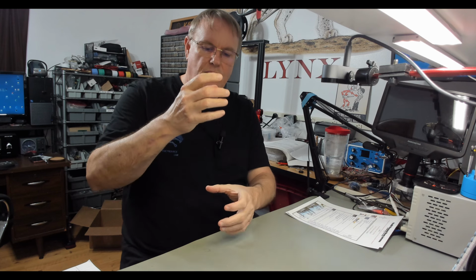I've never taken my antenna down for a hurricane. I have cranked that aluminum crank mast down, bringing the antenna down about 10 feet. You're not going to get the antenna out of the wind, but because it's 2 sections of aluminum tower, by shortening it, I'm doubling up that tower, making it stiffer. I didn't want the smaller section sticking way out in that wind. I was worried it could bend or break the tower, so I brought it down.